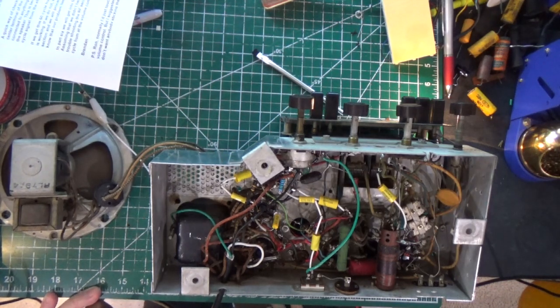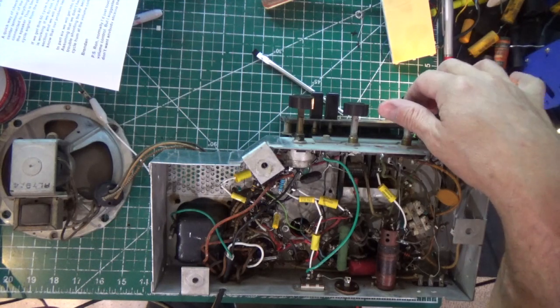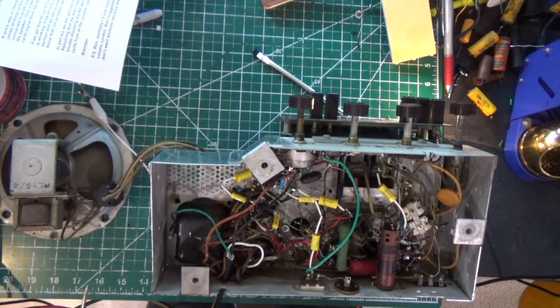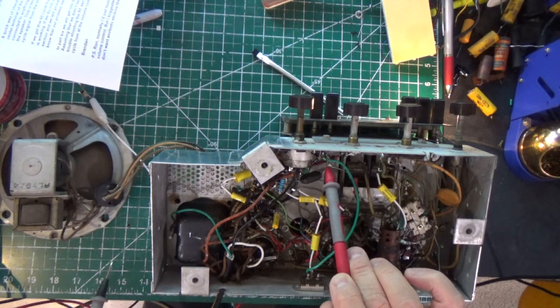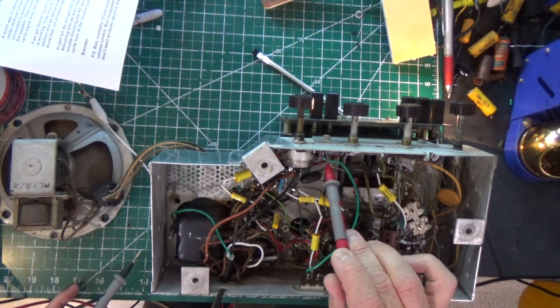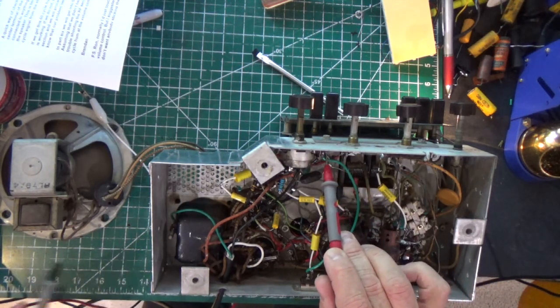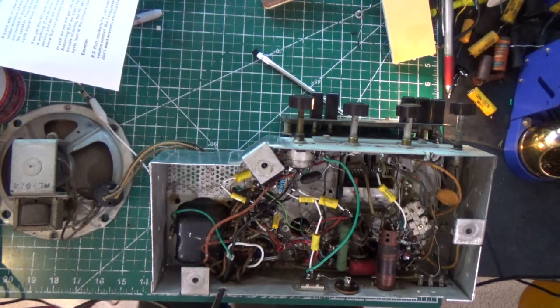Okay, the radio is on. I'm going to warn you — this is going to be loud, so if you're wearing headphones be careful. The radio has a definite hum in it already, which is a problem with my voltage in this outlet. Here's my meter and my two leads — I'm holding the red one and not connecting the black to anything. I'll take this lead and put it on the wiper of the volume pot. There you go — you hear that? What that tells you is the audio section works.